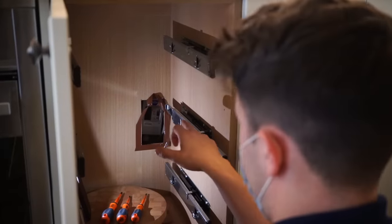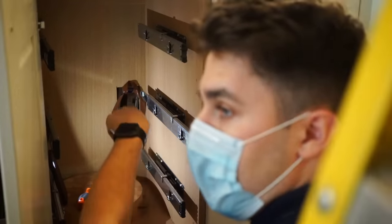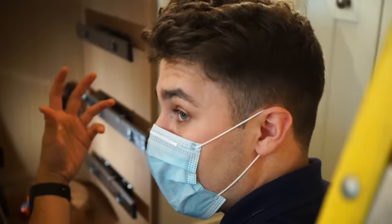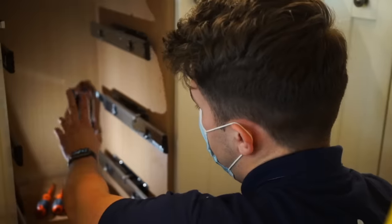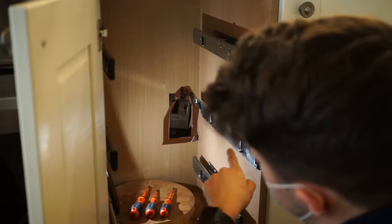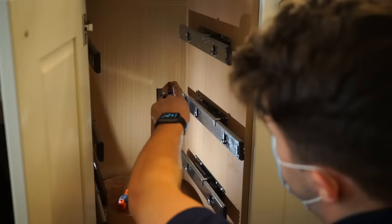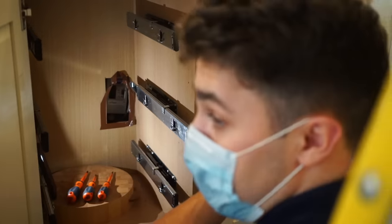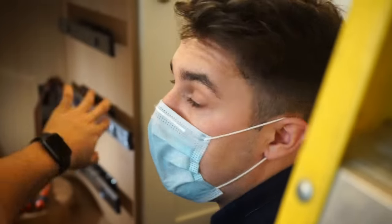I'm trying to get this box out. This box here is a spur off of the ring. And there's an armoured cable on the other side of the wall, which I've just taken the lid off. I mean, you didn't really have to take the lid off because half the back was missing off of the box. It's filled with water, but I'll show you that later. And then you've got a twin and earth, which is poking out of the back of this breaker here. So I'm hoping if I can disconnect it here, pull the leg back, disconnect that cable, I can then run a new length of armoured cable from that junction box there under the floor back to the consumer unit, so that the shed and garden electrics are all on their own circuit and they're not coming off of the house.